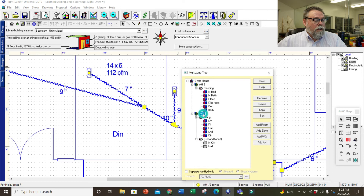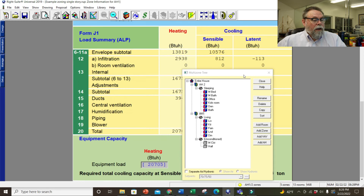I'm going to change this to 0.85 as well. Here in California we don't need 0.70 for a sensible heat ratio. So with that change we're down to two tons again. I need two two-ton systems — before, the house was one four-ton system. Now it's two two-ton systems and we're fine.